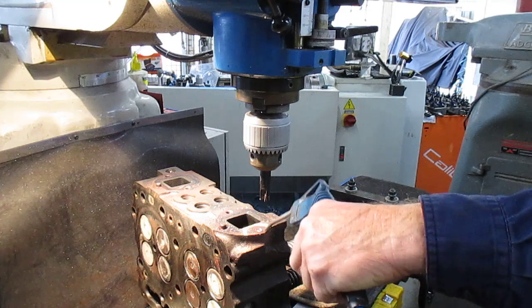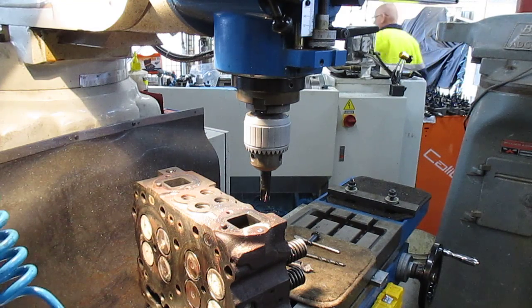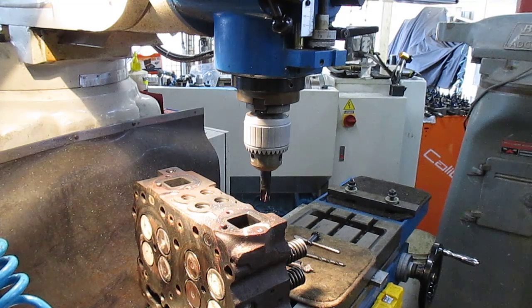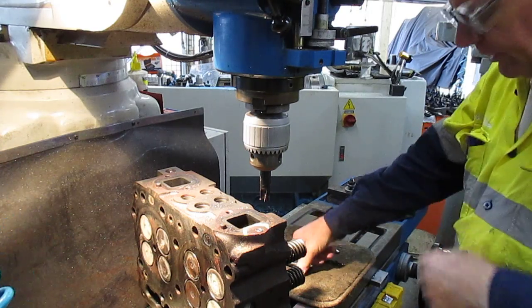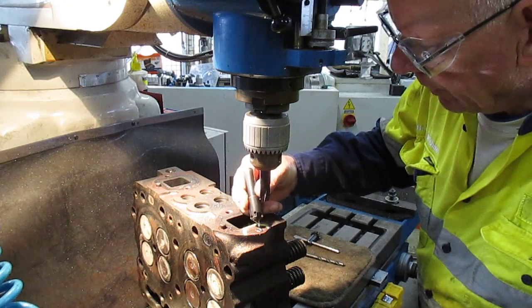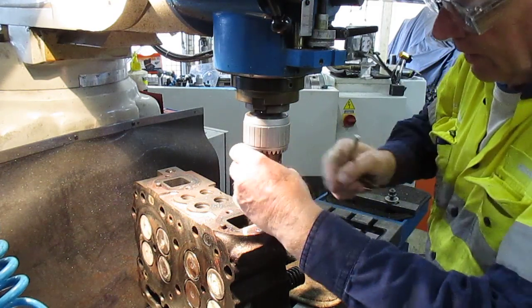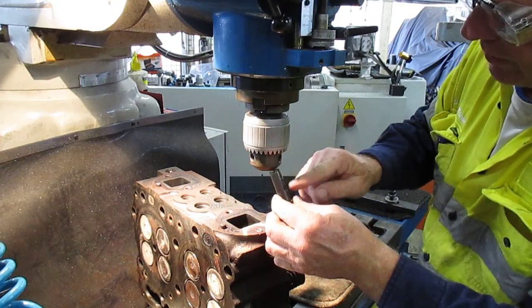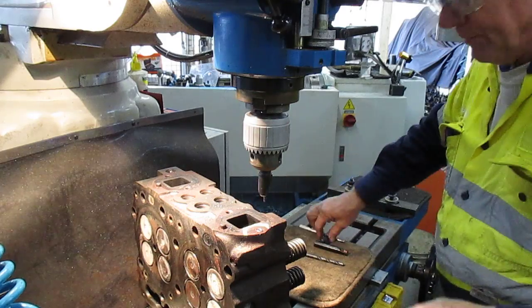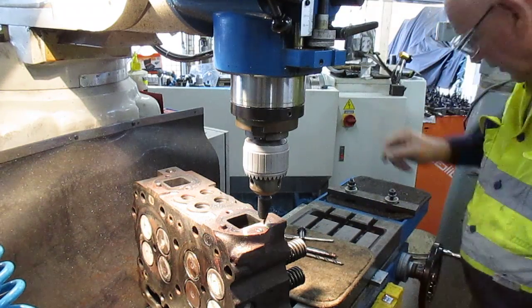Okay, so what this has also allowed us to see is the periphery. And what I'm going to do is see how far I can go with this centre drill first - hopefully they haven't broken anything down below there. These ones have a notch in them, so you must make sure you're opposite the keyhole and not picking up one of the jaws. So we'll go down here and we'll see if we can find the centre.